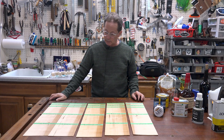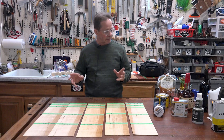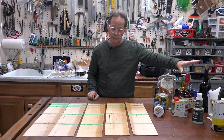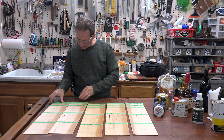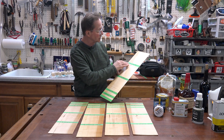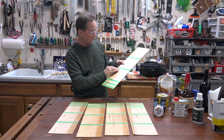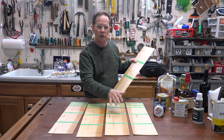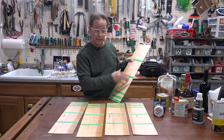There are some big differences between these. I'm going to start with the chemical tests — by which I mean the cold water, acetone, wine, and whiskey — and talk about heat and scratch tests separately. For the chemical tests, the worst one was Osmo Top Oil, definitely the worst. The water glasses raised the grain in all three sections, less so with the ceramic coating but still noticeable. Universally, chemicals and scratches showed more easily where there was wax than any other section.